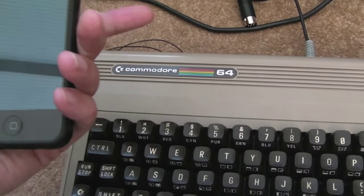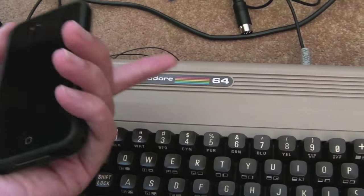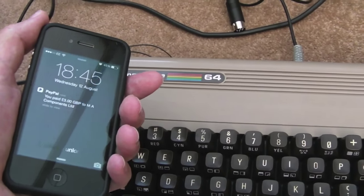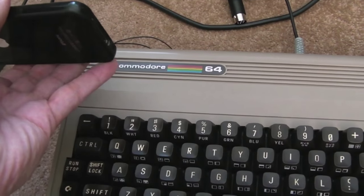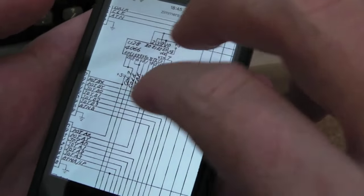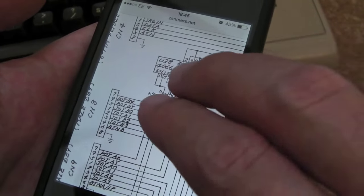The system is working okay in every other aspect — well, I just tested Rainbow Islands and it kept crashing in the same place every single time. Following that, I thought I'd look at the schematics because there's something going on with the input — it's definitely input related. Because on Last Ninja when it skips the intro, the directions are doing all sorts of weird things, like it's moving on its own.